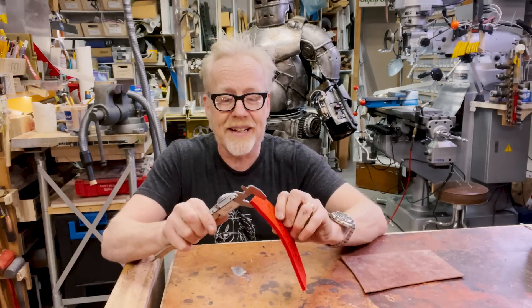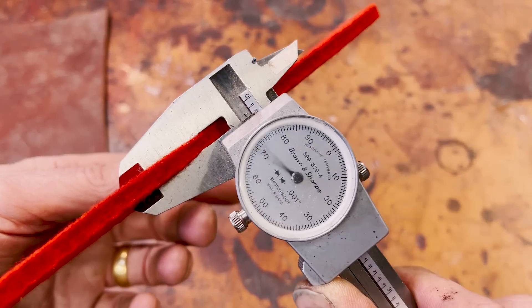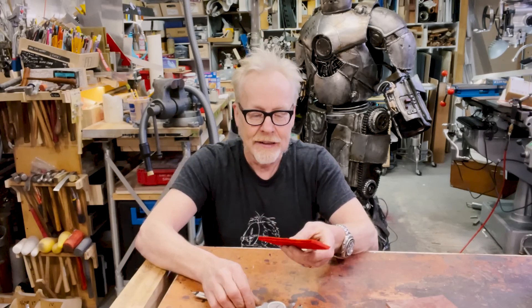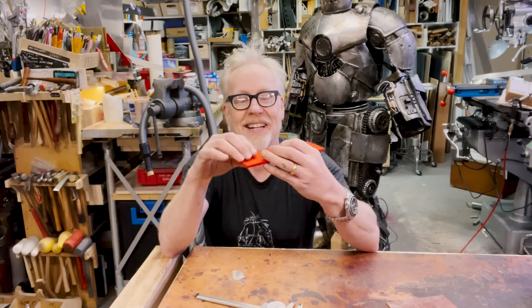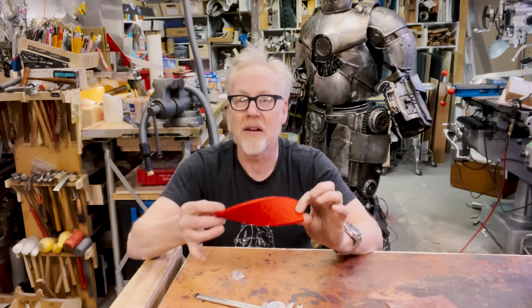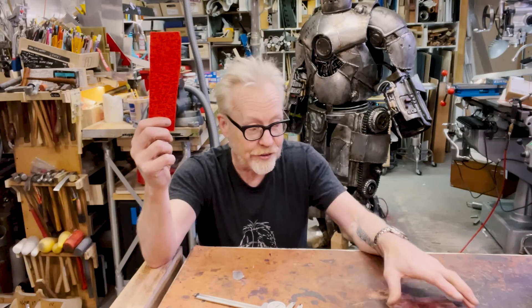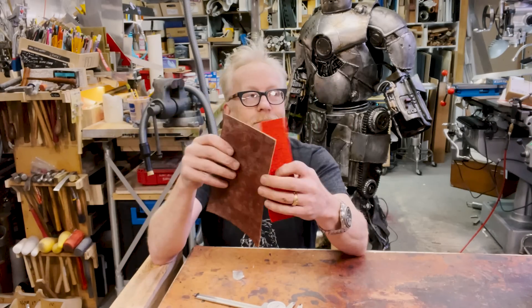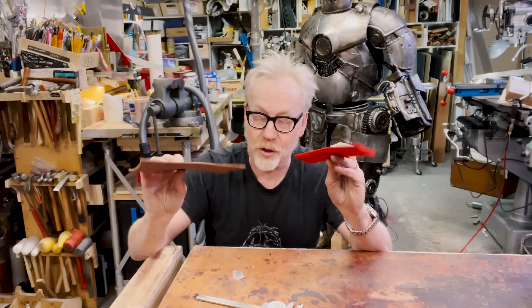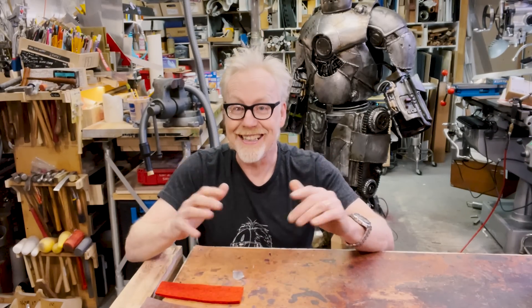When it comes to something even softer like this felt, how do I know what my measurement is? How do I measure the thickness of something like felt? I can't measure its absolute thickness because its absolute thickness is an average across a whole bunch of measurements. Plus, under an electron microscope, the line between the material and the lack of material is also somewhat of a gray area — the material gets thinner out towards the edge. In a case like this, it's not about the absolute value. It's about an absolutely agreed-upon methodology to obtain the value. So in industry, one of the methodologies for consistently measuring the thickness of goods that are somewhat compressible is to use a specific type of micrometer that has a certain amount of pressure to it that is the same for everything it measures.